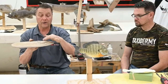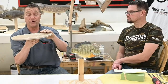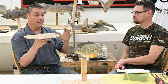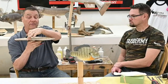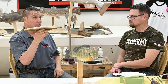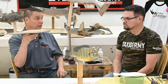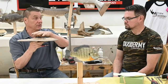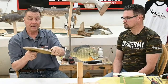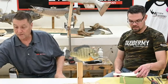We screwed it together carefully without breaking it. I usually set the torque on the Milwaukee drills — they have that little torque setup so you can't tighten things too tight. Another tip: when you make your two halves of the mold, you'll come in the next morning, take your fish out, wash it up, let it dry, only to find you have a big crack between mold half A and mold half B. What we found is: take that mold, put it in the oven at 170 degrees for 15 to 20 minutes, put your screws in — the material is softened — and you will end up with no crack, which means no seam.